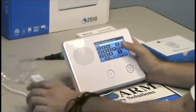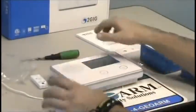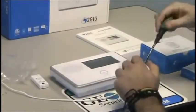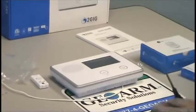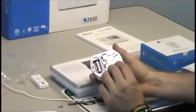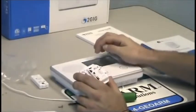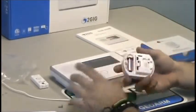Press the down arrow key. Now we're going to enter the TX ID on this thing, which lucky enough for me is on the inside, so I've got to open this thing back up. Usually there's a sticker on the outside of these things, but on this one they just didn't do it. The TX ID will be located right there if you can't find it on the outside. In this case it's 0-6-2-7-6-0-8, and you press the down arrow key to confirm that.